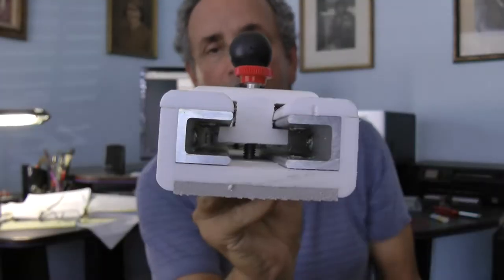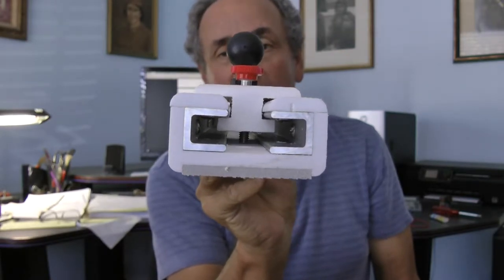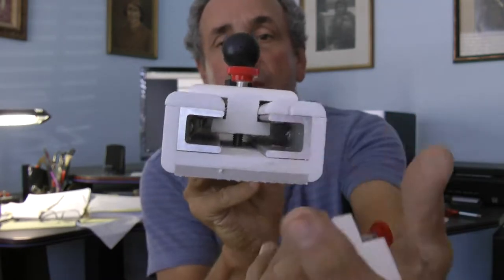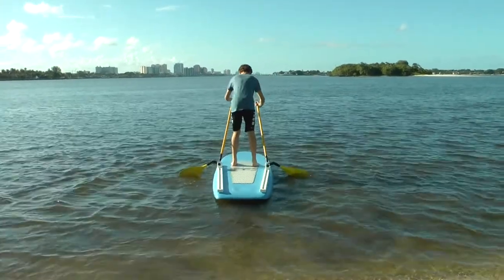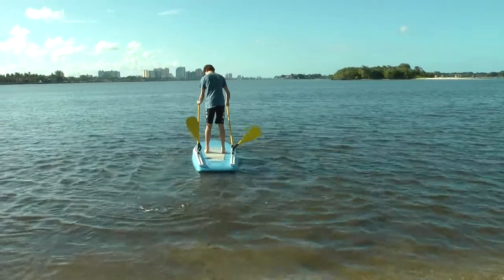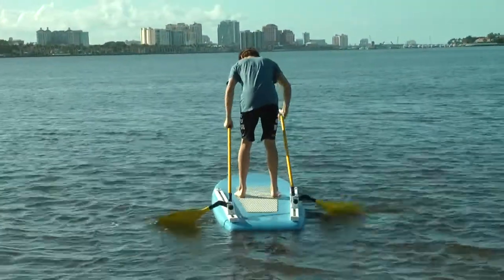The tolerances are that way because of the way we are manufacturing and not because it's perfect. In order to reduce the size of the 7-inch wide plastic base, I used plastic and aluminum to create a narrower track. From a design standpoint, this was a big improvement, but it also altered the dynamic relationship with all the components, and the mechanism no longer slid along the track the way the earlier design had worked.